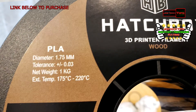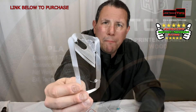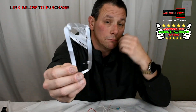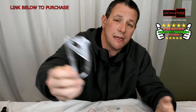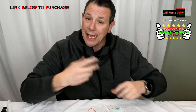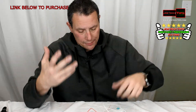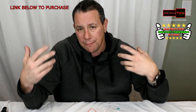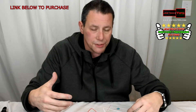If you go a little bit higher than the range, it'll probably melt too high and you'll start getting funky designs in the print — it starts to look melted. See this top here — I had the temperature set too high because I had changed the filament and forgot to change the temperature, and it started screwing up. I had to stop the print, make some adjustments, and change the temperature. I could change it on the fly, but this was a single part.